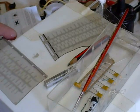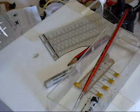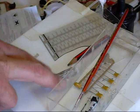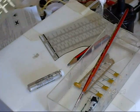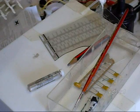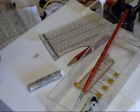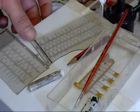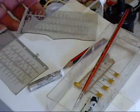These are LCD panel front screen pieces. There's a tin oxide plate on that plated surface. I've just painted some silver conductive strips on it so they'll act as the charge collectors. I've got some fingerprints and stuff on there so I've got to clean it off with a bit of metho and apply the titanium oxide.